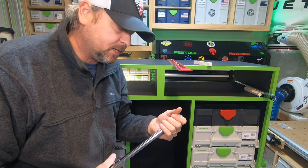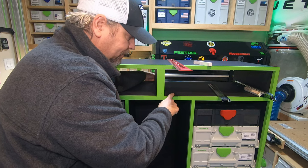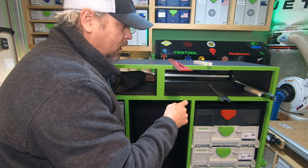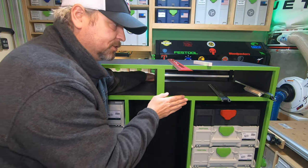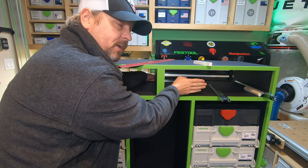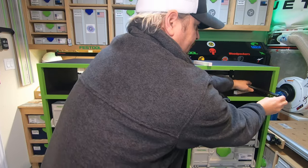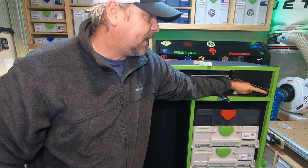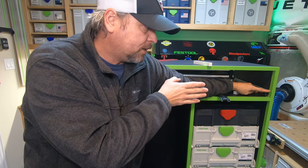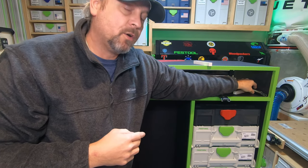In my case that's not a big deal. Since I've got 15 and three-quarters total depth, I'm going to build my drawer box to be 14 and three-quarters inches deep. The reason I'm not going the full 15 and three-quarters is that I'm going to build these drawers inset flush to the trim, so I'm going to attach a false front to the front of the drawer box. To accommodate that, I'll inset my drawer slides by three-quarters of an inch.